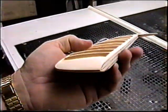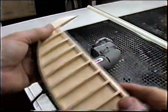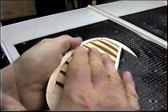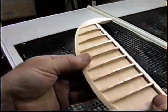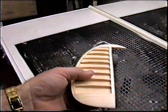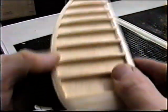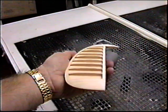I've been looking for a lot of ways to use that, but it really takes some material off. It really brings the ribs right into pretty good alignment. Of course, I'll use a hand block to finish it up, but it really roughs it out nice without breaking any ribs. My problem is, I notice I got a piece of rough sandpaper on there. I'm going to see if I can get a piece of the smoother paper. It's taking too much material off at once. But again, if you have one of these tools, this is a good time to experiment with it.